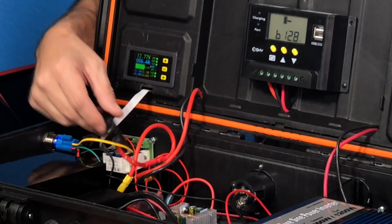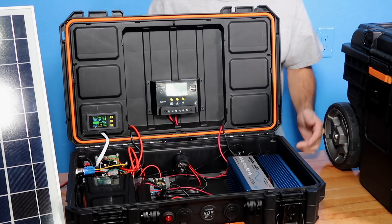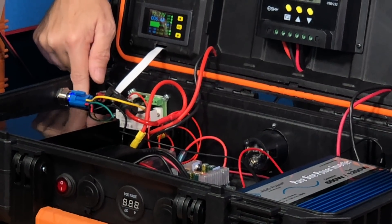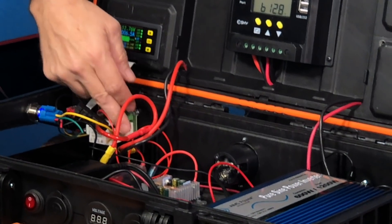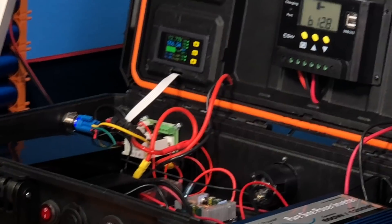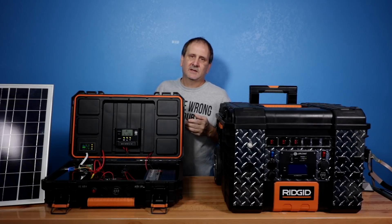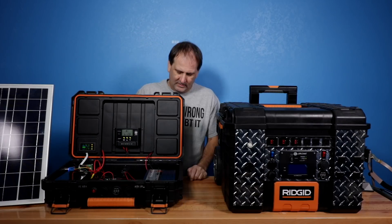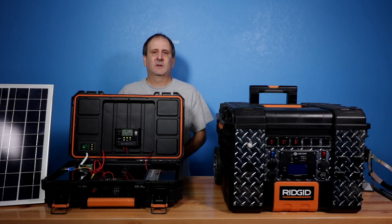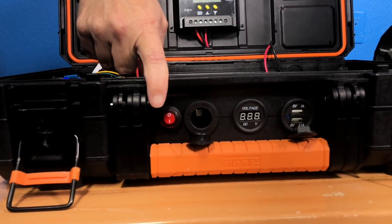We also have a simple four-place fuse panel. There's a fusible link that runs through our hall sensor into our main battery system, and a main power switch on the side that's run through a 20 amp relay to run everything else. We have a negative bus bar inside, and two different plugs on the back of the unit — one that lets solar power in and one for DC coupling, so you can run to another DC battery or send DC into this unit. The solar controller and DC input/output plugs are Neutrik plugs — I'll put a link in the description for those. Up front we've got a 12 volt switch.